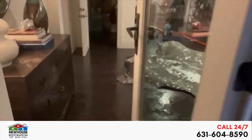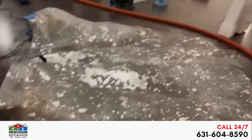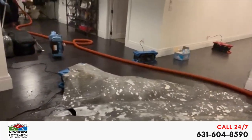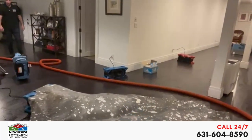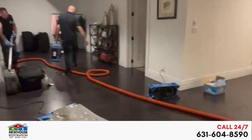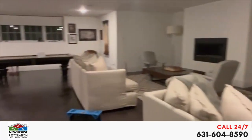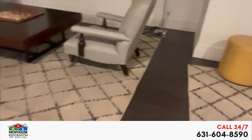Walking in, you can see how wet the floors are. Got the fans going — this is called floating the carpet, where you get air moving underneath the carpet to dry it and then on top. Got the guys extracting over there. The water was just all the way through this basement — probably a couple inches, and you can see just underneath how wet it is.